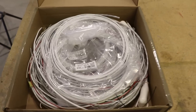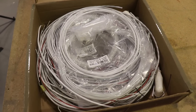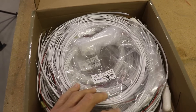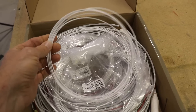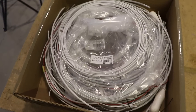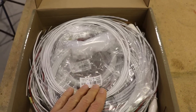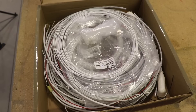A quick note on wire: you cannot go to AutoZone and buy wire for your airplane. The difference between aviation wire and normal wire is in the jacket — if this burns or catches on fire, it doesn't tend to put off the toxic fumes that cheap wire will. You'll pay more for this wire, but remember, you're wiring an airplane, so it's definitely worth getting some aviation wire.